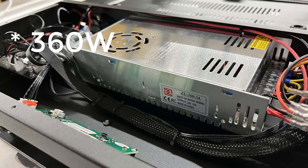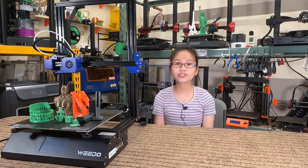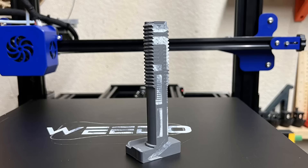The power supply is 350 watts, which is better than the 270-watt CR10 power supply. However, for a larger print bed, especially when the major selling point of this printer is printing high-temperature filament like polycarbonate carbon fiber — which requires a 285°C nozzle and a 120°C heated bed — waiting for the printer to heat up to these temperatures takes more than 15 minutes. This takes a bit too long, and I would prefer at least a 480-watt PSU. The white paint on the print surface comes off and leaves marks at the bottom of your prints. I suggest the manufacturer work on the paint, or simply replace the center logo with a smaller logo in the corner, or just use a textured PEI spring steel sheet.